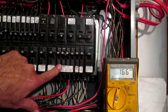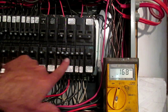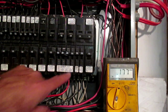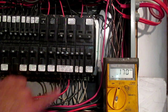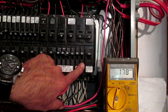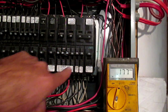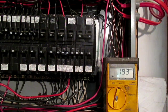Here is another form of breaker where you can really start getting bang for your buck. We have two 15 amp breakers and two 30 amp breakers in two slots. Basically it goes from here over to here — two full slots, we're getting two 30 amp circuits and two 15 amps. What we've got to do is something similar to that, because to wire our range we require two 40 amp breakers. So I'm going to take the mini breakers out of this slot and the breaker out of this slot and insert a breaker that will give us the amperage we require.